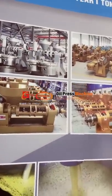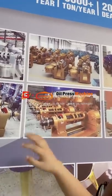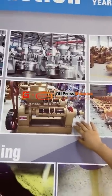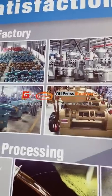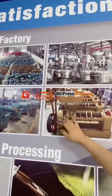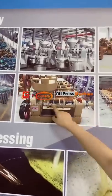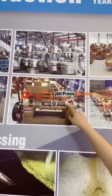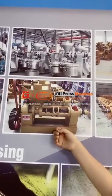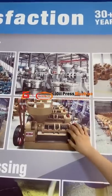Here we can see the machine outside, it looks a little different. We can make a simple introduction like this one. You can see it is just a simple structure like this, just a feeder. It's the feeder, just put the seeds inside, then the gearbox transfers power to make the machine work. With this pressing, the seeds go inside here, the oil comes out from here, and the cake from here.